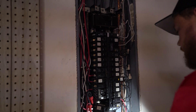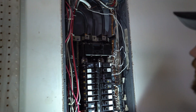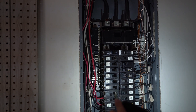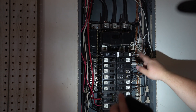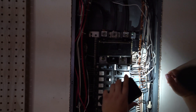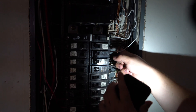I need to slide this back in and set this down. Next thing I want to look at is the ground to neutral bars — that would be this bar over here, this bar over here, and then there are some bars tucked behind these wires. I'm looking for anything such as double-tapped neutral wires and just making sure everything's properly landed. As you can see, it's one wire per screw, and that's done excellently. I'm also checking that all the grounds are nice and tight — you want to pull on them all and make sure everything is grounded properly. None of these wires are moving.